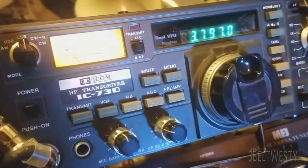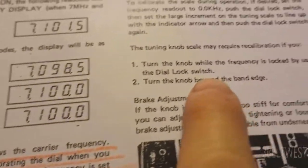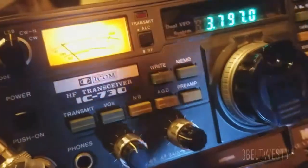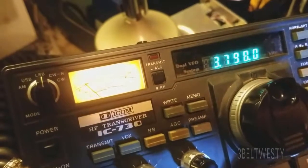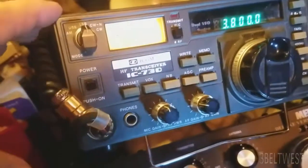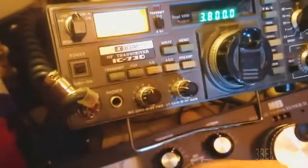That's the purpose of this video on the 730 — I really didn't even know this, I just assumed the dial position was random. Reading the manual about the tuning control knob calibration, I didn't realize the lock knob was how you set that. It's kind of a neat rig and it's simple — I kind of like something where the knobology is simple and straightforward.